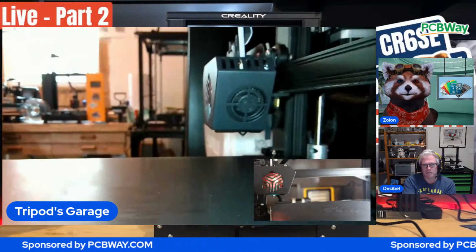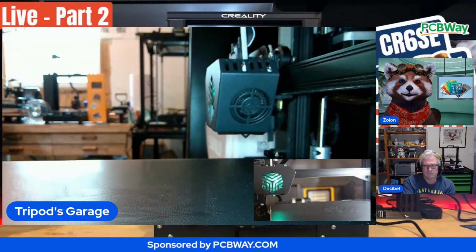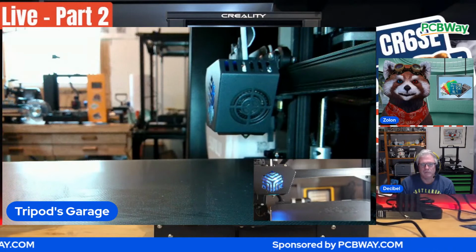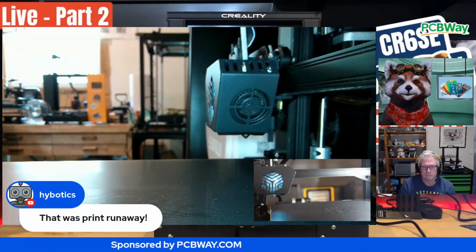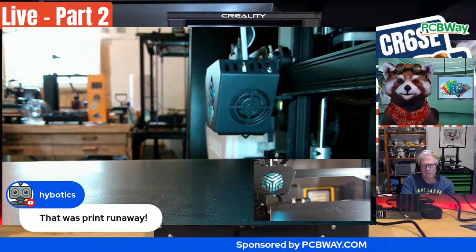Not anymore, because I've accidentally destroyed a piece of glass and a PEI sheet with PETG and TPU. I now print both of those on the flip side of a bare spring steel sheet with just a couple drops of Vision Miner nanopolymer. It works great. That stuff works good, supposedly, for that size of bottle.